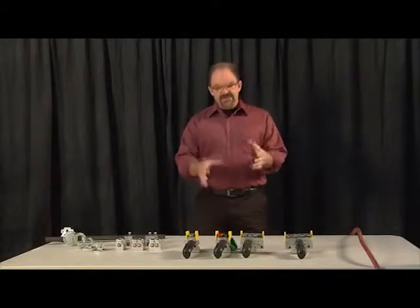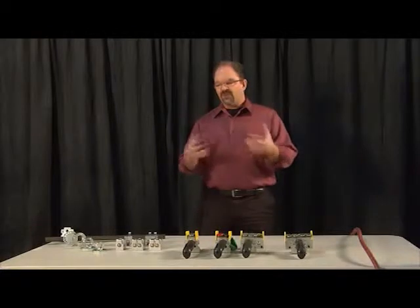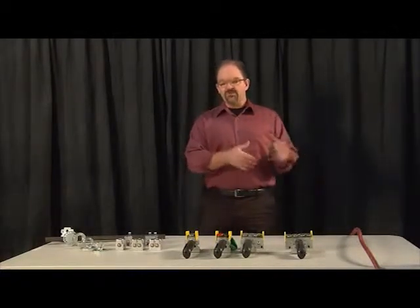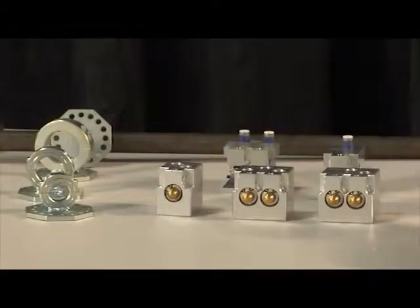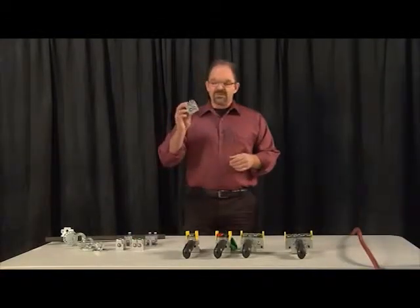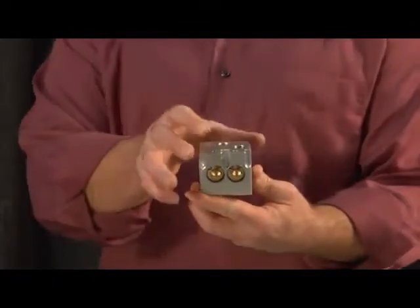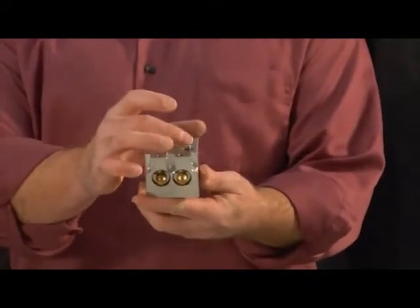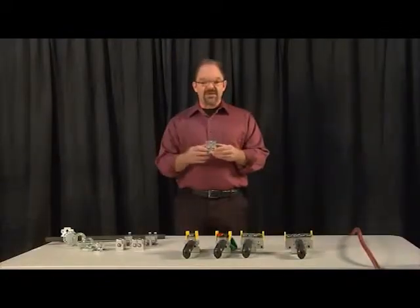Now, getting into what these actually do and how they're built up is the next step. We want to talk a little bit about the valve blocks and electric blocks that can make up these handles. So of the 1, 2, 3, and 4 button handles, every handle consists of one of 5 different blocks. So the one that we have first here is what we call the rear exhausting 3-port valve. The rear exhausting 3-port valve is for pressurizing and depressurizing or exhausting a canister or a tank or an air balancer in the material handling industry.